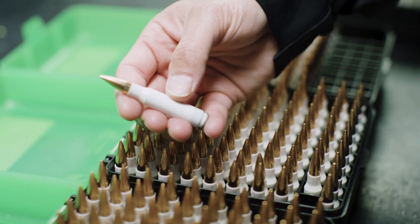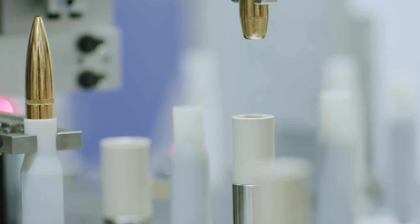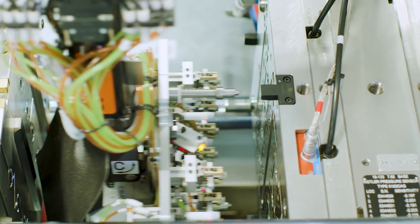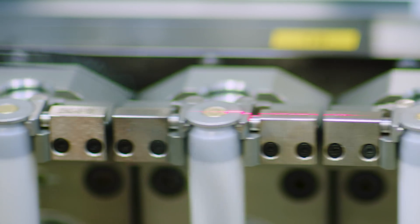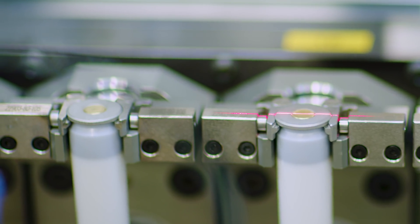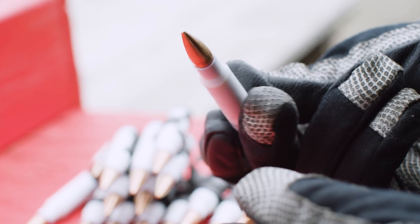In a brass cartridge, the internal shape or profile very much follows the external profile. While in our case, the external profile is dictated by the chamber; however, the internal shape is dictated by how we mold the part. This allows us to shape the way the powder column burns, and thus the way gases are produced and then move the projectile down the barrel.